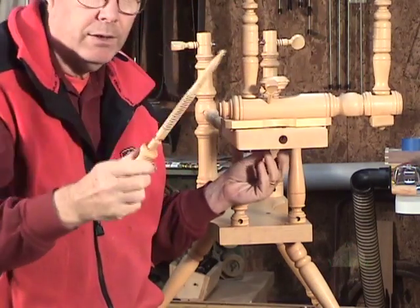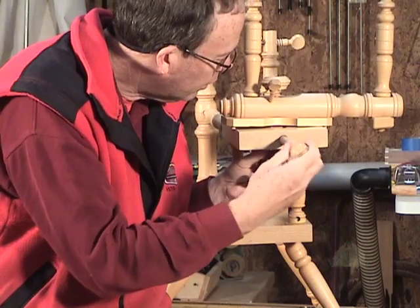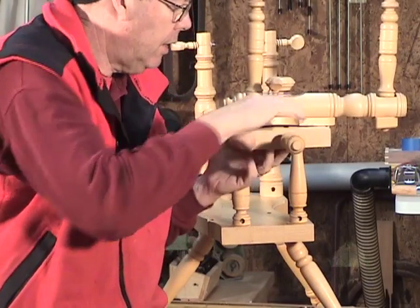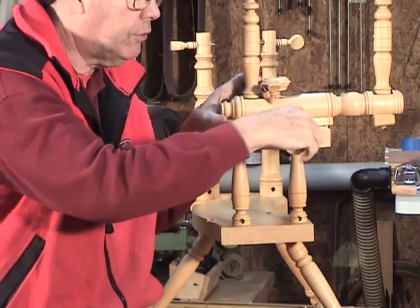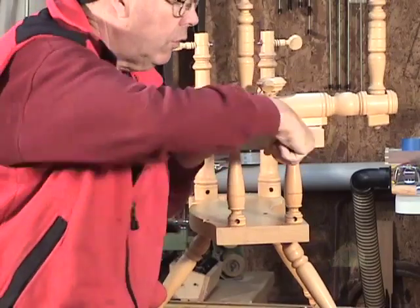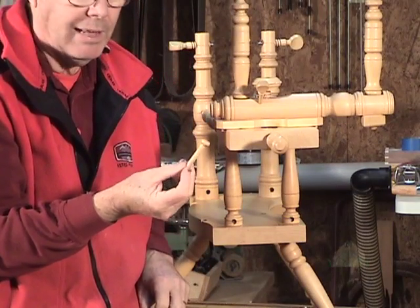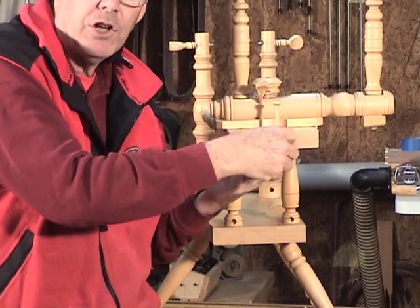And what we're going to do is take this adjusting rod, goes into the end of the bench and through the hole that's in that other threaded part we just installed coming up from the bottom. And you'll want to thread that through it. And like these other long adjusting screws over here, this adjusting rod has a notch in it. We want to get that into the bench so that we can look down through here and we can see the notch. And we're going to take our last long little peg here and we're going to push it down through here. This is going to lock this adjusting rod in here.